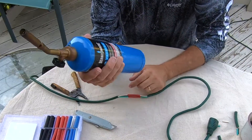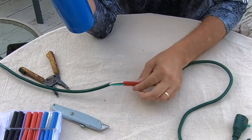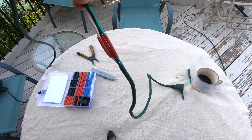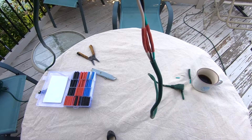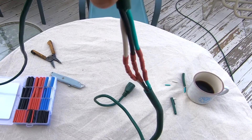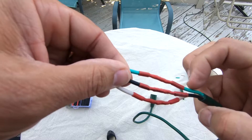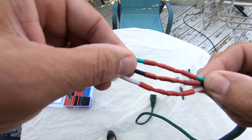The last thing we need to do is apply a little heat. I'm going to use this propane torch — not letting the flame touch the plastic, because obviously it'll melt or burn it. We're just trying to apply a little bit of heat so that these covers shrink up tight. You can also use a heat gun, a hair dryer, or some other kind of heat — just don't let the plastic come in contact with the flame. With just a little heat, you can see how it's shrunk right around those wires, nice and tight. You can see literally where the jacket of this wire ends and then it just shrinks tight right around them — it's a super tight fit.